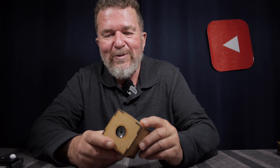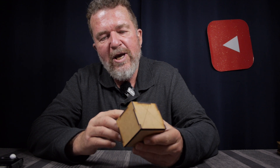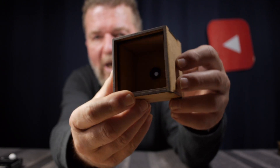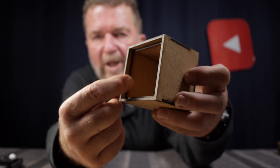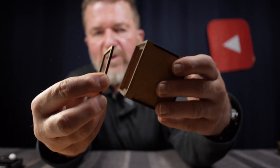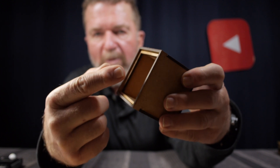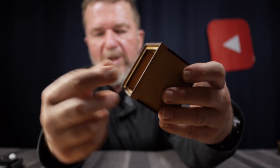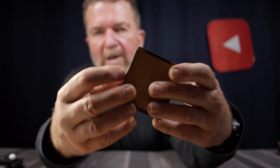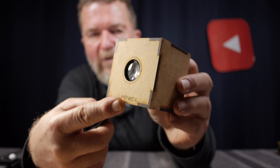I was playing around with this camera last year and started thinking about it a couple days ago. It has a nice glass lens — a fixed aperture of about five millimeters, the way I measured it — and it's designed real nicely. The back of the camera has a flange where you can place the photographic paper, preset for infinity focus. There's also a spacer frame about three or four millimeters thick; if you put the spacer in first and then the paper behind it, the paper will be preset for a distance of maybe a meter or two. It takes exposures in the realm of about 20 minutes in bright daylight.